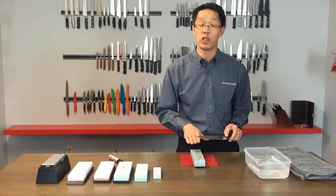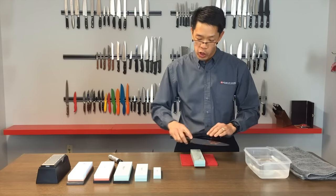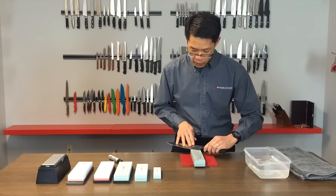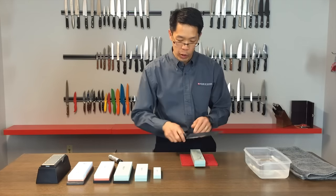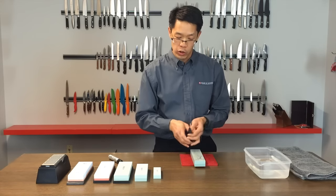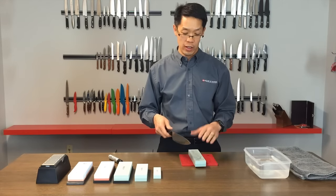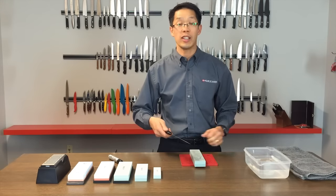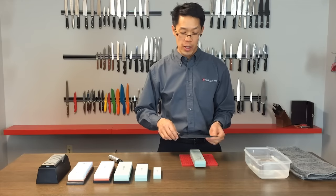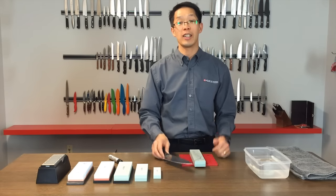The sharpness or dullness of your knife will dictate which grit you start with. In this case I've chosen the 1000 because this knife is pretty sharp — I'm just giving it a touch-up. If it's fairly sharp already, alternate your strokes from one side to the other. If it's in really bad shape, work one side at a time before alternating. Depending on the quality of steel and the grit of the stone, it can take anywhere from six to maybe 24 strokes on each side. A sharp knife is a safe knife — thanks for watching.